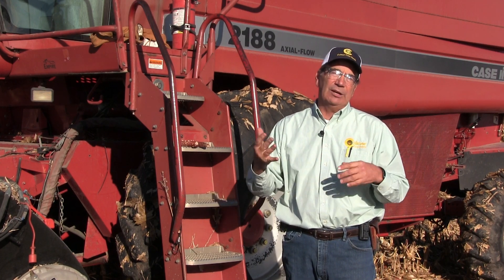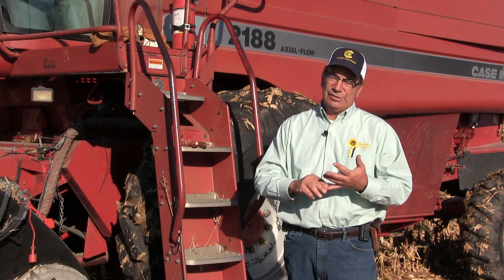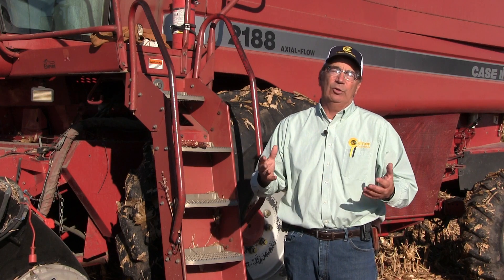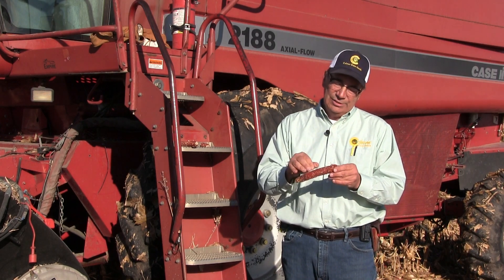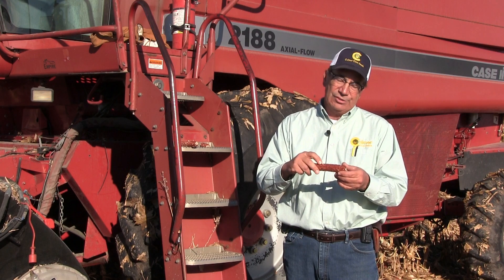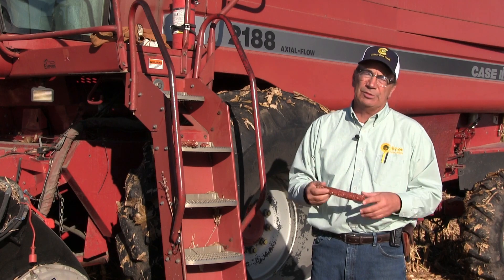Now let's wrap up with setting the concave clearance. This is something that's changed for me just over the last year, and again it comes from having this harvesting seminar — I get the combine as far out of adjustment as I could. This fall I had the concave wide open. We took off down through the field, did the first kill stop, and there were no kernels on the cob. I said, well, I really don't have a reason to close it back down. You can see some of the bee wings — the red eye is still on this cob. There are no marks on it where we've tried to over-thresh it, and there's no upside to that either.